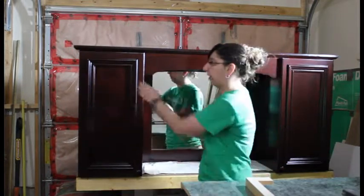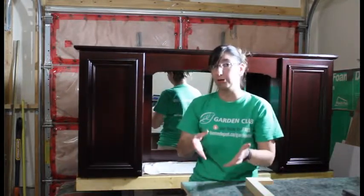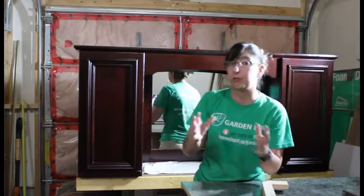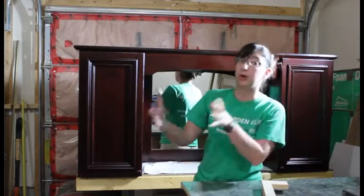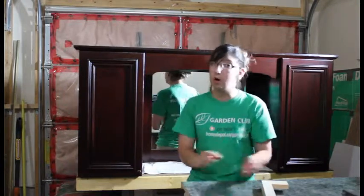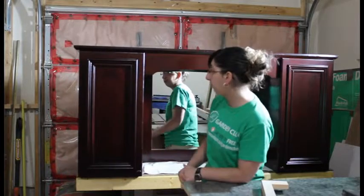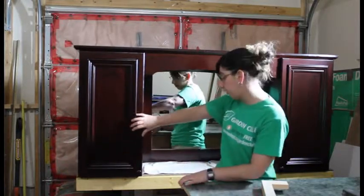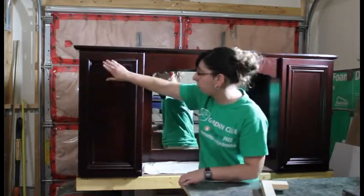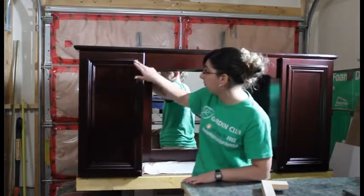I wanted to make it feel like this part is attached to it, so it's got that overlay. Their other door was a raised panel door, but they didn't want to spend the expense on it, but they wanted to have the look. So this was a solution where the cost was a little bit lower, but the detail and the effect were all there. That's pretty much everything else on the cabinet, and this was all just added with pin nails and puttied, with miter joints in the corners.